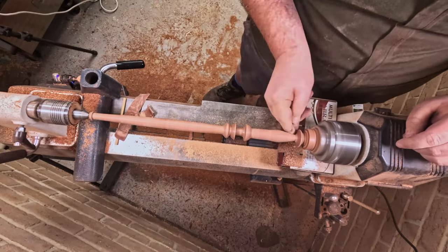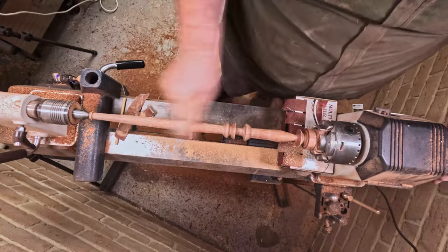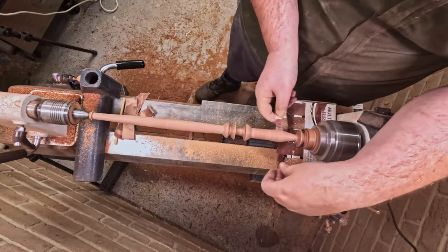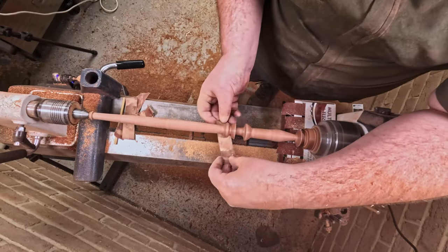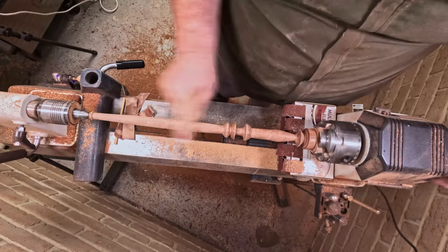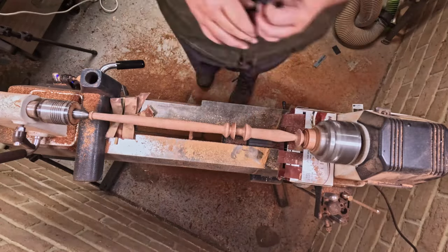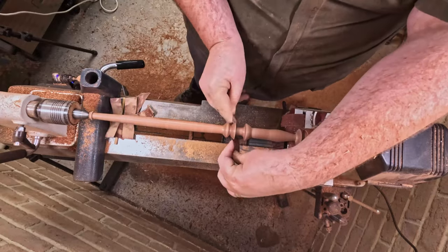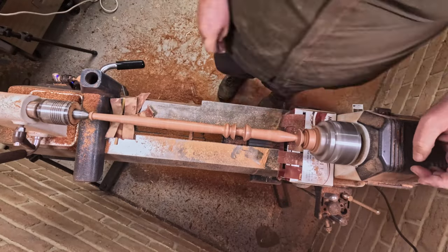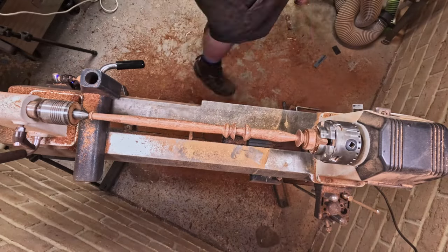What I'm doing here is using my finger to try and fill out any rough spots, then going with the grain, folding the sandpaper layer in between and getting in those grooves. I did at one point stop and grab a stick to get in on those coves — I couldn't quite get my fat fingers in there, so I grabbed a piece of 6mm dowel and used it on the inside of the sandpaper.